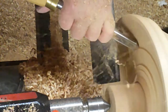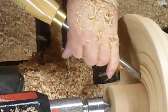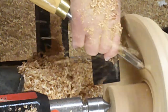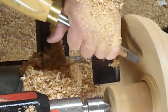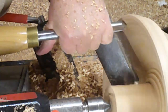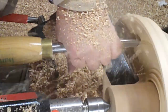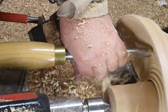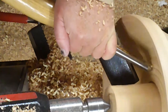It's quite difficult to work with because the winter growth rings are really, really hard and they stay hard, yet the summer growth rings — where most of the spalting seems to appear — are quite soft. When it starts to spalt it goes quite grainy and wants to chip a lot, and it's very difficult when you're trying to cut it with a chisel, because you're going through from hard to soft, hard to soft, all the way down every time you move your chisel through. And sanding is an absolute nightmare as well, because the minute you start sanding, the summer growth rings, being a lot softer, will sand away almost straight away while the harder winter rings stay in place, and so you end up with all these ridges right the way down through the work. So you do have to be very careful.